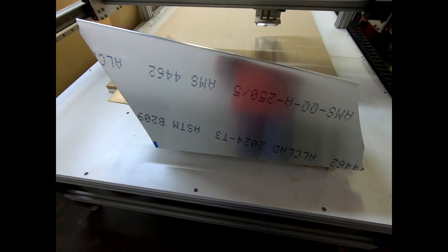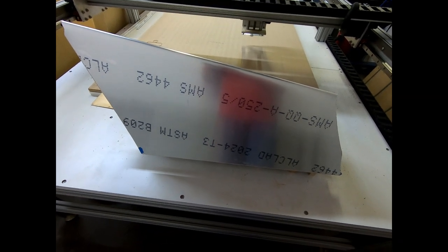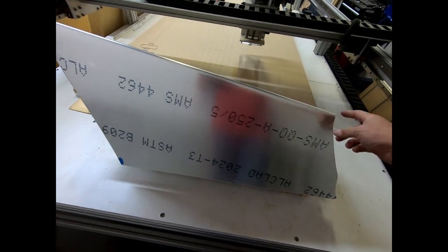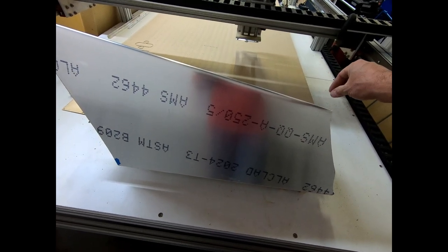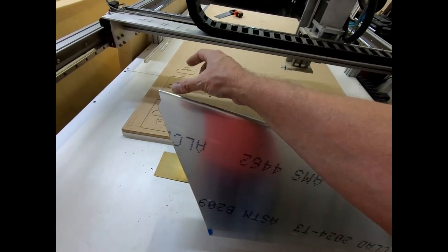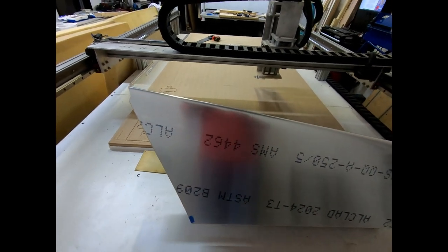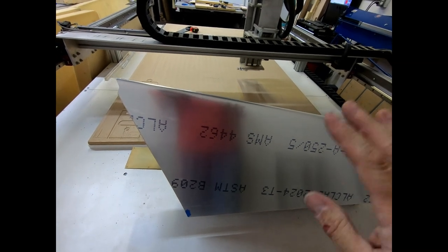So, all right, I was able to get the skin folded. I didn't do anything high tech to do this at all. I literally just put some shims and a stop underneath one corner and some shims and a stop at the other corner, so that when I push the board down, it just hits those two endpoints. I didn't do a tapered piece or anything like that, and just put pressure across the board.